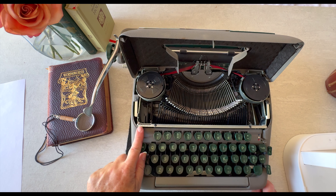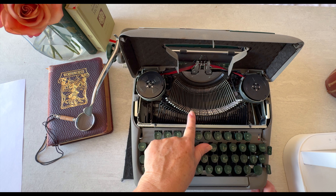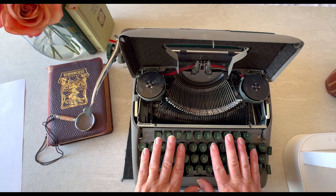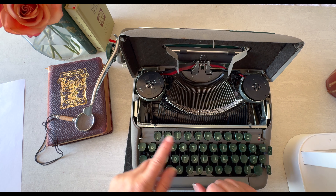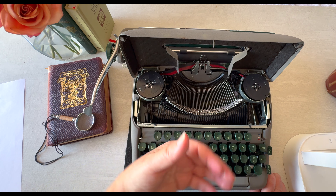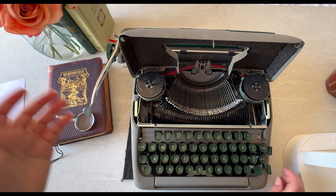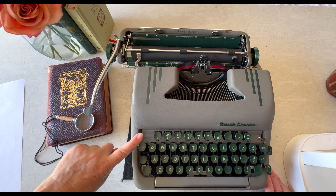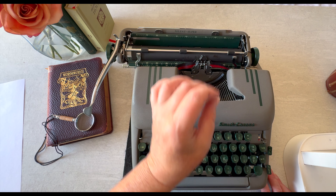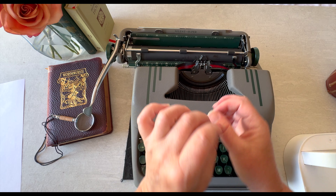This is your tension selector down here on the left. It determines how hard the type bars are going to strike your paper. You can also adjust the tension by how hard you physically type — my husband has a very heavy hand, I have a very light hand, so we would have different settings. As you get more proficient and more sensitive in your touch typing, this will become more important. Some people ask whether typewriter ribbons automatically reverse — that only happens if there's a grommet on the ribbon. Ours don't have grommets, so they must be manually reversed.